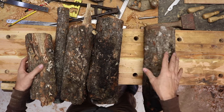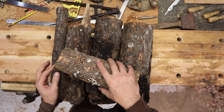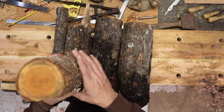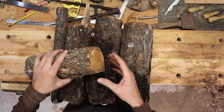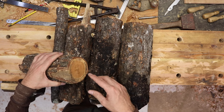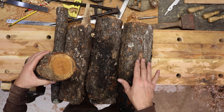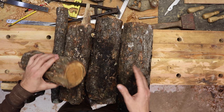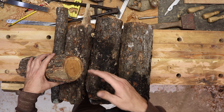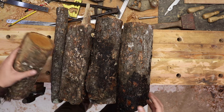I've got pieces here off the fire pile. If you don't have any dried firewood and you want to do something similar, you can cut a branch off of something — ask a neighbor. There's not a neighbor out there who doesn't have a fir tree that wouldn't like a little free pruning. Even if it's green, use it anyway — it's going to check and might crack a little, but that kind of makes it even cooler. If you're going to use green wood, use a glue that works well with moisture, like Gorilla Glue, because the wood will move.